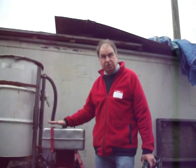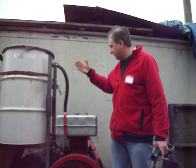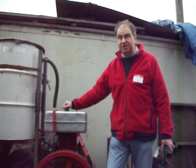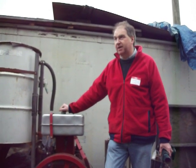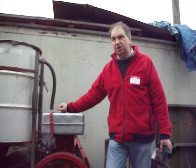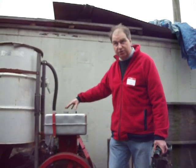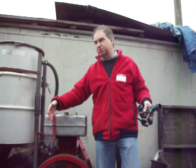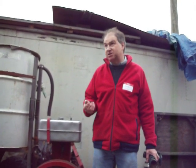Because this is a water-cooled engine, you also have water coming out at about 180 degrees Fahrenheit. I have one of these in my shed in my back garden and I run my home heating off the waste heat from the coolant. I've also got a tubular heat exchanger on the exhaust, and I can get about six kilowatts of heat out of it, which is sufficient for my thousand square foot home.